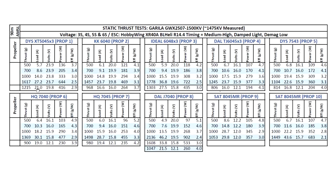On 5-inch, if you want similar performance to other motors of higher KV, the typical KVs, 2300, 2500KV, you'd want to run at least 5S. Then on the 6-inch props, on 4S, it's also a little bit low on thrust, so you'd probably want to run 5S. Then with 6-inch triple blade props, looks like 4S is pretty okay, I think.